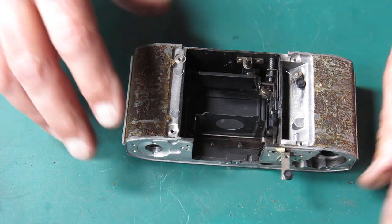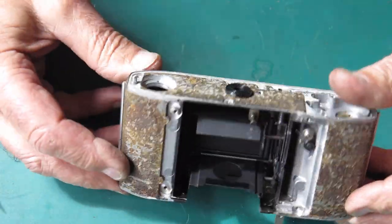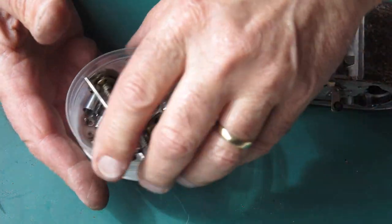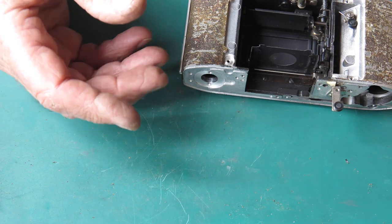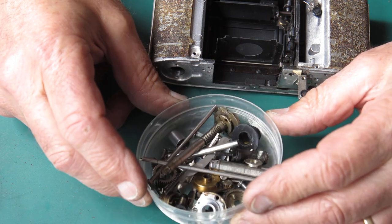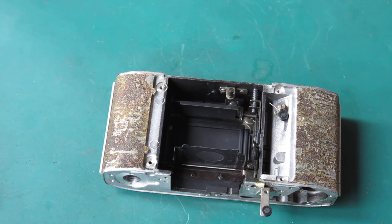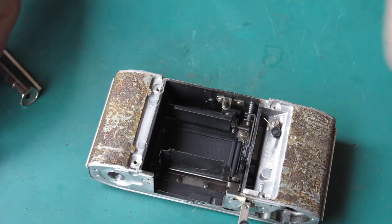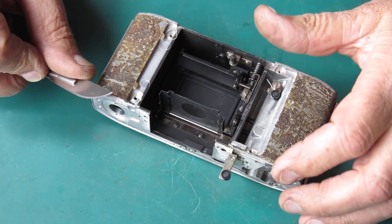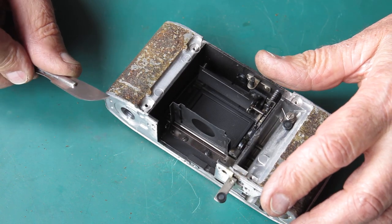With that piece put aside, everything else is relatively robust. So there's my camera body. These mechanical parts are all going to have to go into the ultrasonic cleaner. I give them 15 minutes in solvent to loosen up all that grease and adhesive and rubbish, then 15 minutes in hot water with a strong domestic detergent, rinsed carefully under a hot tap and dried carefully with a hair dryer. The parts come back looking like new — in fact, looking better than new.